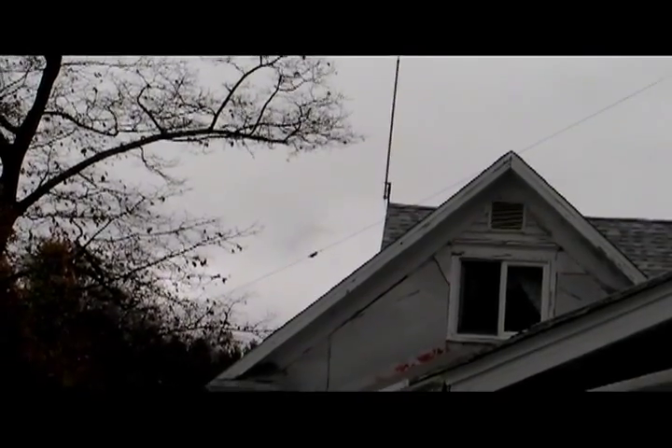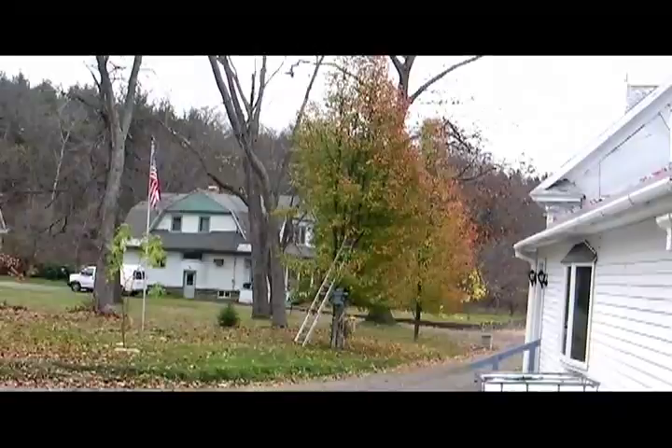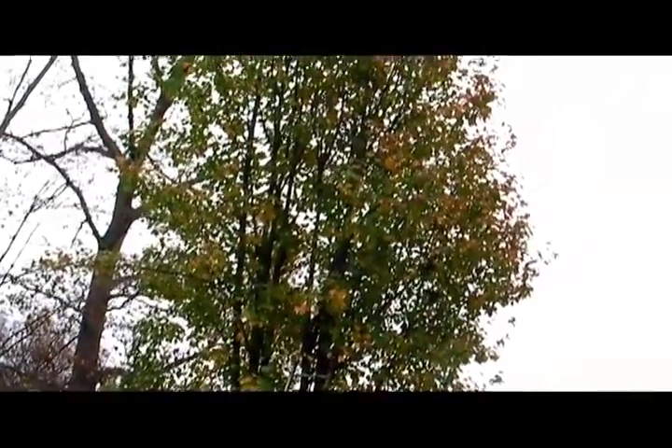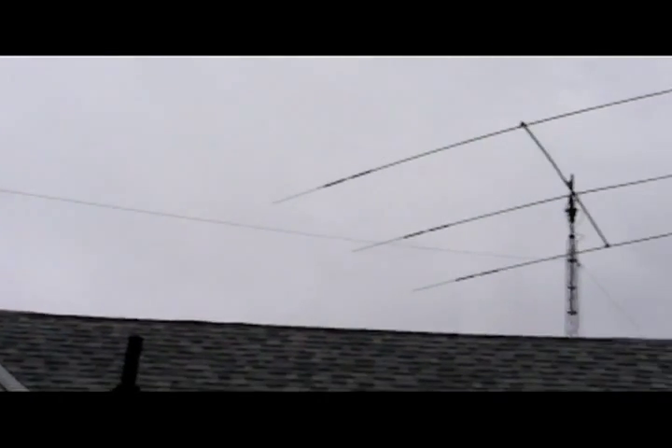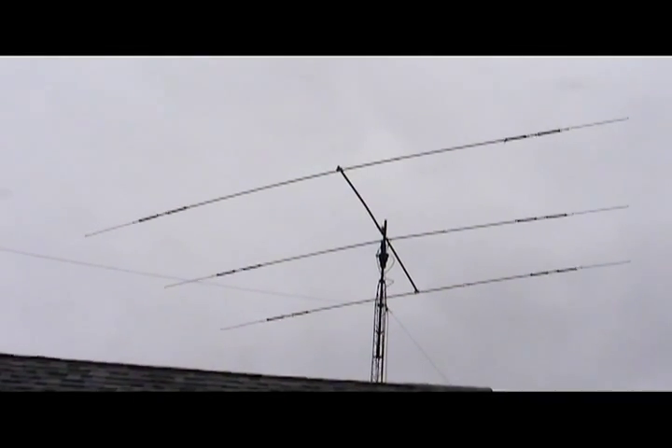You can see it's only a couple feet over the top of the house. Right there is the 80 meter coil, and then it runs on over and attaches to this little tree. There's the tree, there's the 160 coil, and there's the 80 meter section which is right over the house. Let's go into the shack and check the SWR.